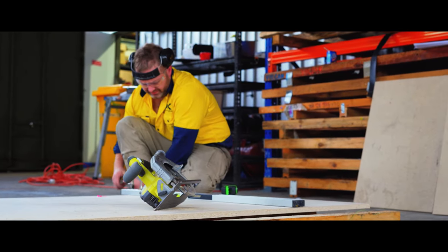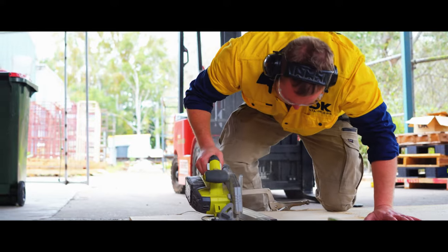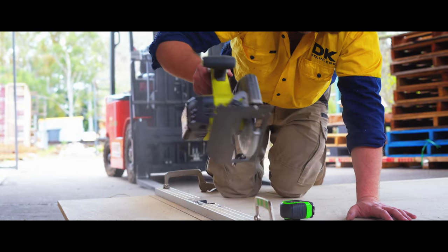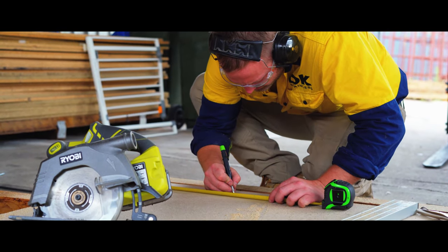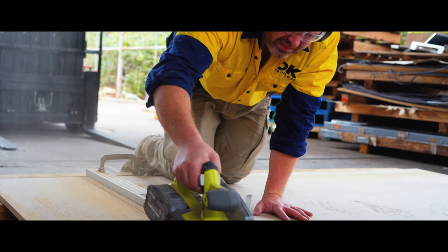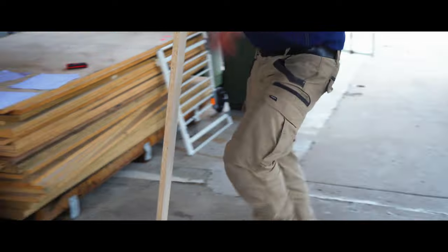Quality is the biggest thing. Having everything done to within half or 1 millimeter means that when everything goes together, your tolerance is extremely tight. If, let's say, you cut everything to 1 or 2 millimeters, and each part is 2 millimeters bigger, and it goes together with 4 or 5 different parts, you may find that the end product of this template might be 10 millimeters larger.